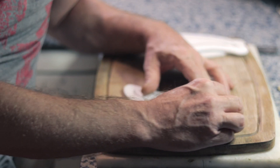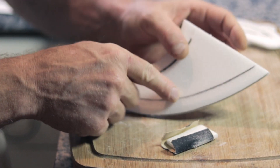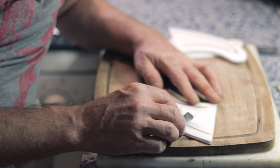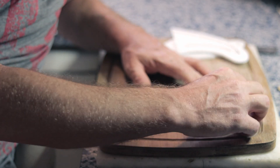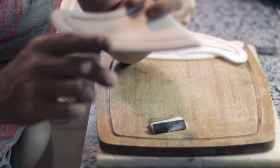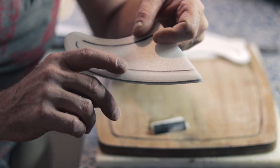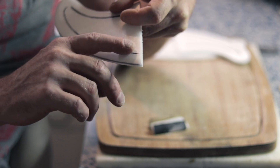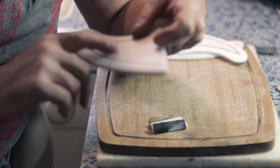Once you've got this edge, you can see your line that you've created. I know where I want to be, which is my black line. So once I get to halfway, start to move your block up to a new angle, and take away that line. Try and keep the angle the same. Once you start to take away the second line, you'll end up with a third line until you get to the inner line that you've drawn. You should have a nice sharpish line around. Take that line away and keep going until you get to the middle, each side.